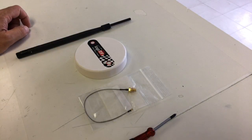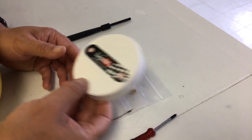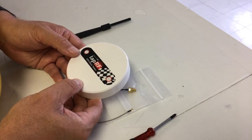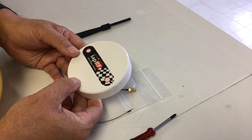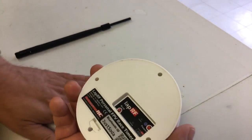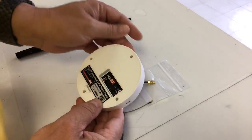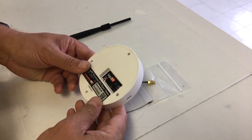You might want to upgrade your Bluetooth antenna to give you better range. At this point in time, the LapRF comes with a standard small Bluetooth antenna that gives you around 30 meters range. This means you have to be about 30 meters from your main racing gate, where the LapRF is set, with your phone or tablet in order to communicate with it and read the lap times. The LapRF allows you to race up to about eight people at the same time — of course with higher pilot numbers you lose some resolution — but this is a great little device. We have been testing this for two or three days and had quite a lot of fun.